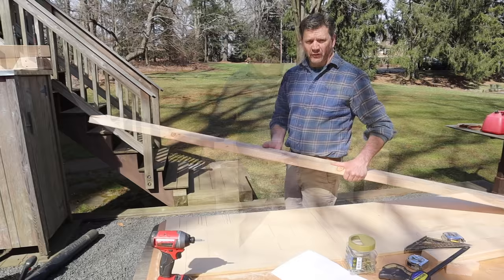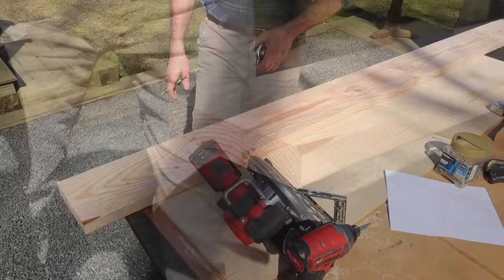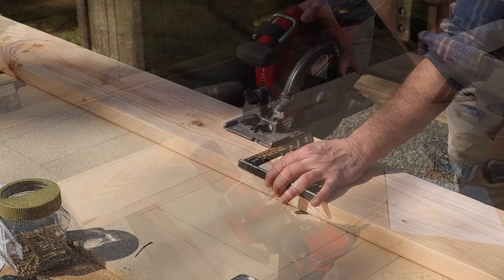You can see how these are the bench legs. Now that they're made, the next step is to make the bench seat. For the bench seat, I'm using a two by eight — I'll cut it in half, put it back together, and that will create the seat. Instead of cutting it exactly in the middle at 48 inches, I'm going to cut it at 46, and that'll allow me to just clean a little off the edge from each side. With that end cleaned up, I'll pull from that edge, make a mark at 46, use the speed square to square across, and that's the line I'll cut at.